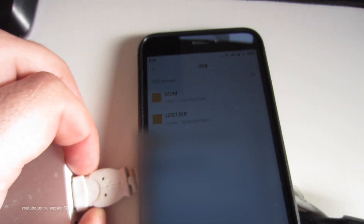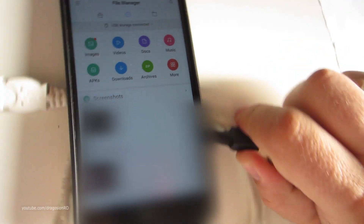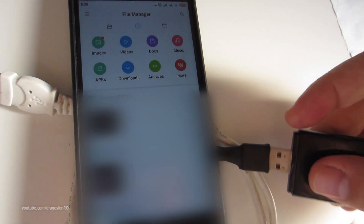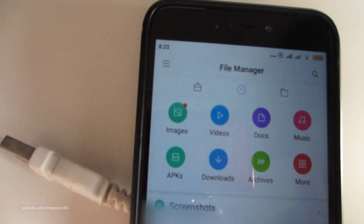That's pretty good. So this is charging with just a wire, without any resistors. Don't waste your time trying to put switches and resistors. Just make sure you have a device that is compatible — it depends on the OTG modes and which one is default. You could even change it through software if your device is rooted, to change the OTG behavior to how you want it.